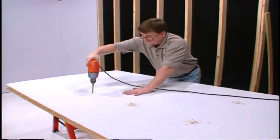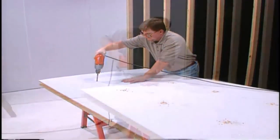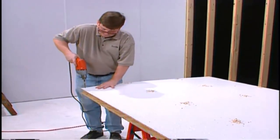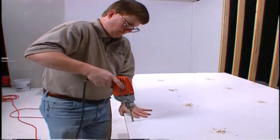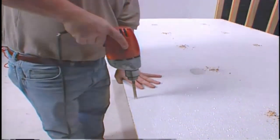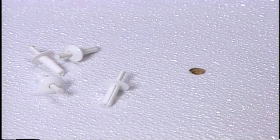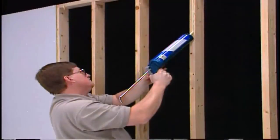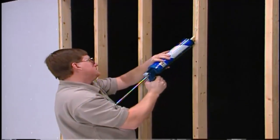Chemply panels should be fastened with non-corroding screws, nails, or nylon drive rivets. Place fasteners every 8 inches around the outside edges and every 12 inches on the intermediate studs. Stagger the fasteners on the opposing panel edges next to the division bar to give a tight, flat seam. Fastener holes must be pre-drilled oversize by one-eighth inch to accommodate normal panel expansion. A bead of general purpose construction adhesive should be applied to each stud just prior to installing the panel.